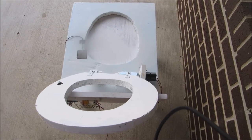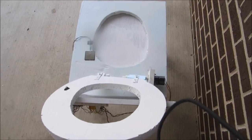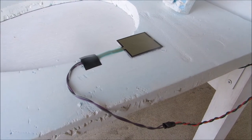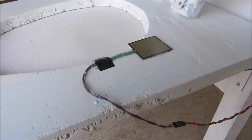Here's how it works. A motor connected to the hinge of the toilet seat keeps the seat in a naturally upright position. When a button on the floor is pressed, it activates the motor, which then lowers the toilet seat. Once the seat is lowered, a force sensor activates that will keep the seat from being raised back up while the person is still sitting on it.